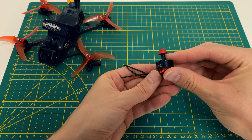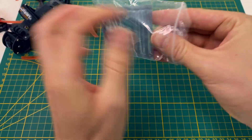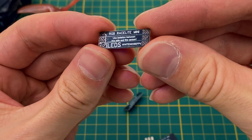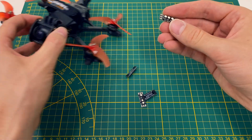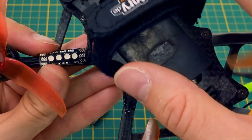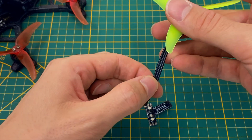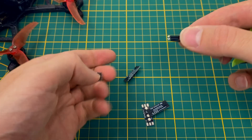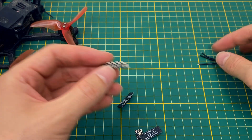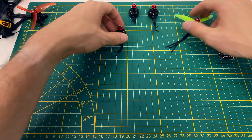But that's not all. I also ordered these cool race light wire RGB LEDs. They get soldered between the motor and the ESC. Why? Because they look freaking awesome. Plus I just wanted to try them out and see if they take my drone's visuals to the next level. Of course there are pros and cons. The upside is that the motors are easier to swap out because the solder joints are more accessible. The downside? More weak points that might fail over time. I'm curious to see how it holds up.